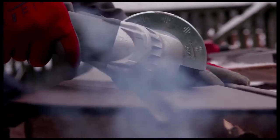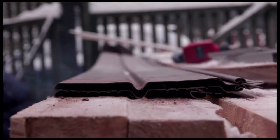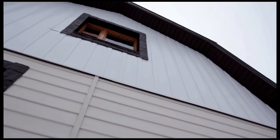Alternating unperforated and perforated soffits, install one side to the J-channel and the other side to the J-fascia. Why do we alternate them? Alternating perforated and unperforated soffits allows for ventilation of the space under the roof. Use J-channels to form bends where the soffits join.